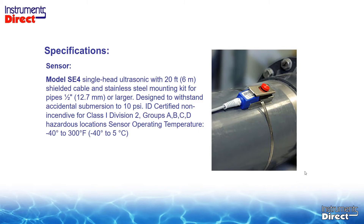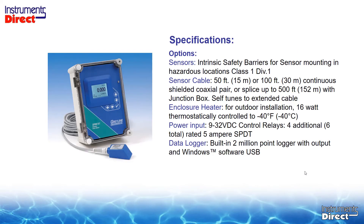You can get Class 1, Division 2, but you need to look at some options to make that applicable. Temperature sensors go up to 300 degrees F. Some options available: it is intrinsically safe providing you select that option — you can have an intrinsically safe transducer with a barrier, meaning you can put the transducer in the hazardous environment and the transmitter in the safe environment. Some municipal applications are becoming intrinsically safe or explosion proof, so you can put the transducer in the metering pit and the transmitter outside the pit in the safe environment.